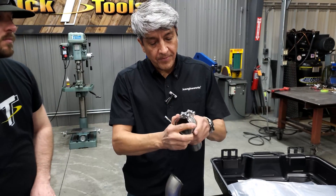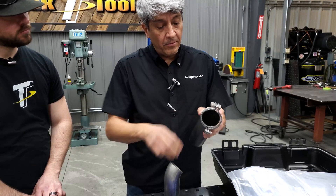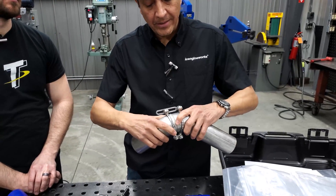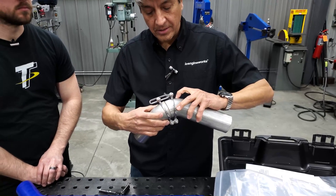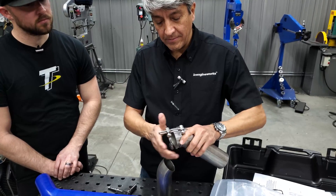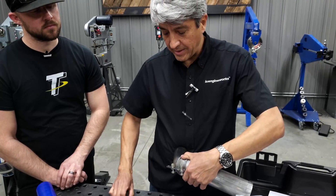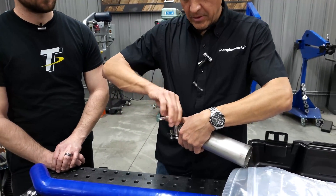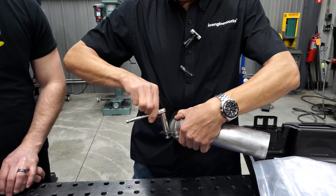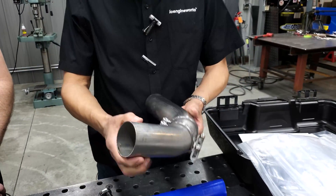A general rule of thumb is to find the highest point of each of the tubes. When they're aligned that's not a problem, but when they're in different angles or planes, that's when we need to find those top points and ideally place the adjustable link in between them. That's what allows us to close the possible gaps, because what we want is concentric joints that are also gapless so that you can just simply do a quick fusion.